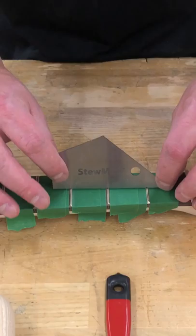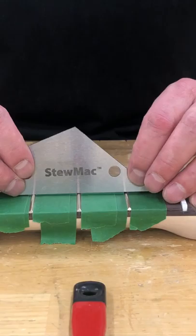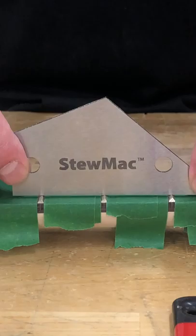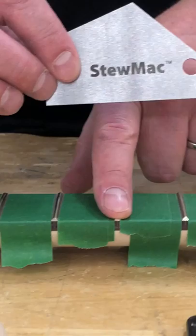It's as easy as just laying the masking tape down, making sure that the fret stays exposed. The first tool we're going to use is called a fret rocker. What it's designed to do is span three frets. If we had a manufacturing problem and a fret was actually taller than the ones beside it, the guitar wouldn't play right. We set this in place and gently try to rock it — this one is good, there's no movement, the fret rocker stays in place.